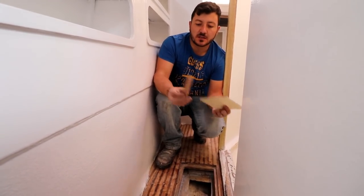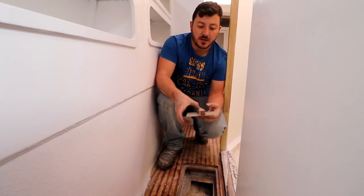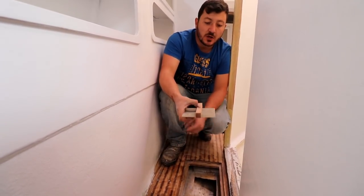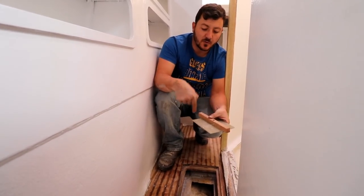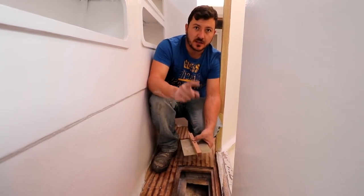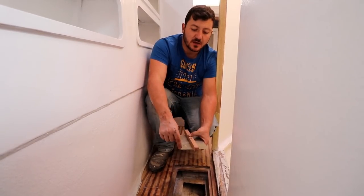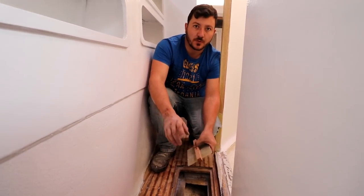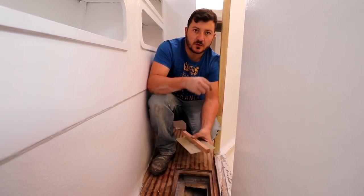What I'm going to do is get this piece of wood, drill a hole through it, put it onto there, drill a hole through the fiberglass, and that will hold it in place — because this is precisely the same size as the hole, so if I just drop it like that it would fall through. You can alternatively use a hot glue gun and do the four corners in place, let it set, and then do your resin. The only problem with a glue gun is that polyester resin and epoxy resin will both dissolve the glue gun compound, and then obviously it will fall through — so you'd have to do a section, remove the glue, and then do the ends wherever you've left out.